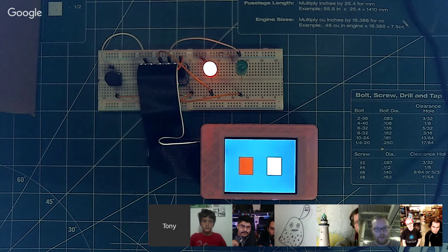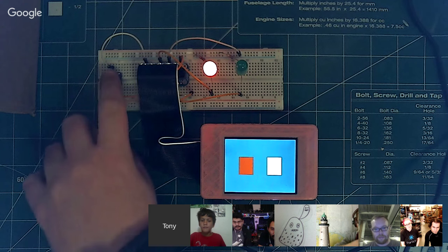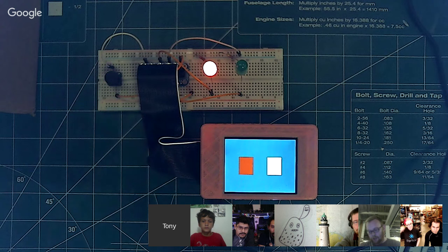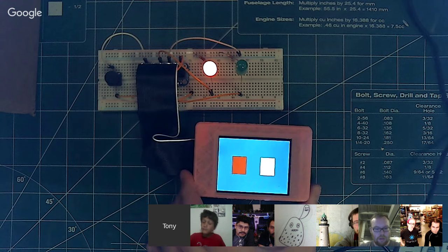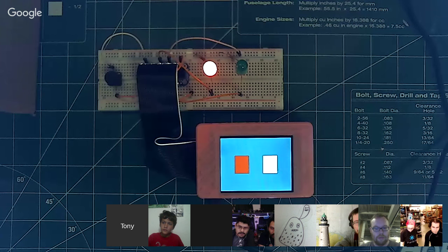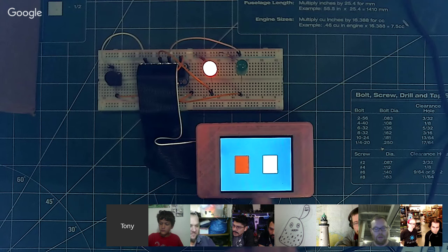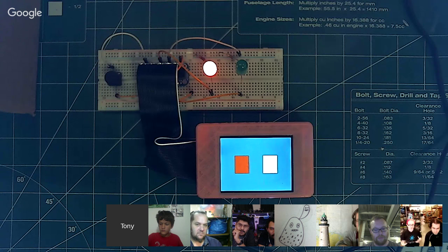It's really similar to the Arduino API, the wiring protocol. You can read inputs also — when I press this button, the screen turns blue. It's a cool way to get started. If you have a Processing sketch already, you can add some interactivity to it, add some buttons. The Pi is not as fast as your computer, so a really advanced sketch that does 3D stuff might not run well, but simple stuff or prototyping works great. You could build a menu system and prototype a little hardware device. The Pi TFT worked natively, which is really cool because it just goes through X11.